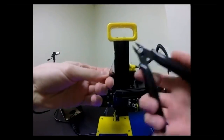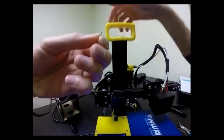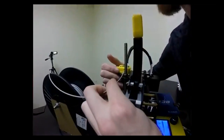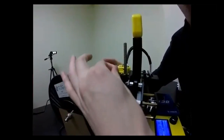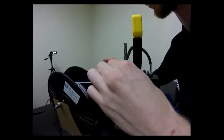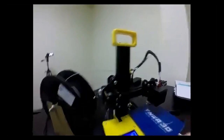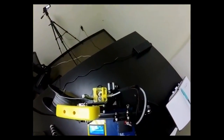Squeeze the extruder trigger, push the filament through both the extruder and all the way through the tube. Once it's through, push a little extra to purge any old filament or old color that was in the printer. You'll see plastic oozing from the nozzle — that's how you clear colors. We find filament flows best at 220°C. To change the nozzle temperature manually, click the button, go to Controls, then select Nozzle and adjust the temperature — up to 245°C max.